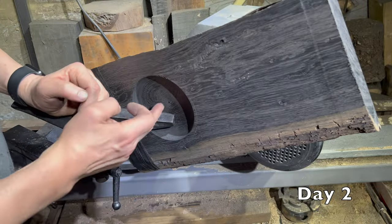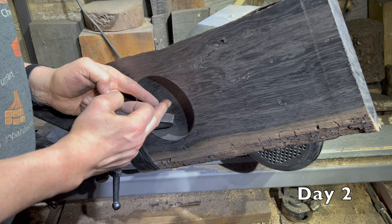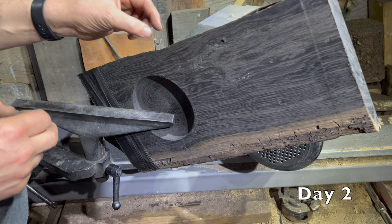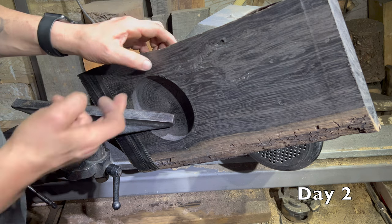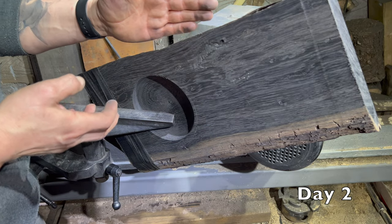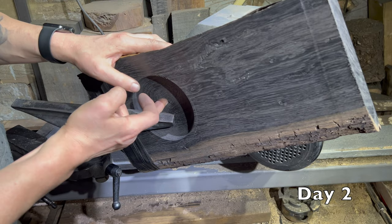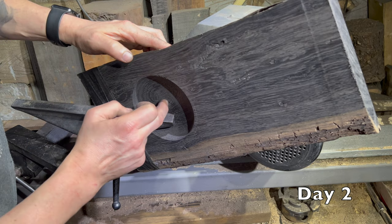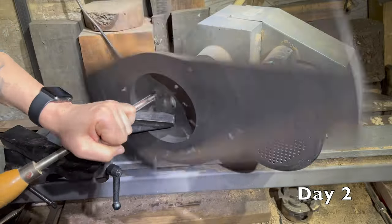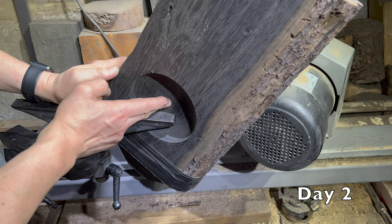To gauge the depth, I take the deepest point, look down the side of the piece, mark my finger there, bring it back up to the side, and I can see I've got about 14 to 15 millimeters before I go through the back. On a piece like this I'm going to leave at least eight, nine, ten mil at the back for finishing both sides afterwards. I want to get a nice even curve — tiny bit bigger but not a lot. Happy enough with that — sandpaper will smooth that out nicely.